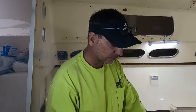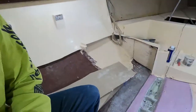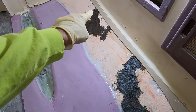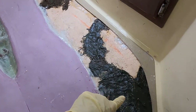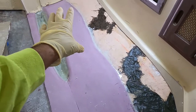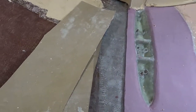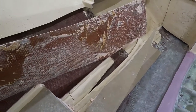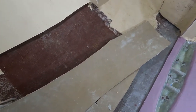I've got all of the foam down, the cracks filled, and the voids filled. I'm getting ready to sand this — you can see I've got everything filled: all the cracks filled with thickened epoxy and heavy fiberglass filler in these areas. Getting ready to sand all of this. My plan is to lay the original floor back down; I've got to clean the bottoms of it up and get it ready, but I'll show you what it's going to look like.